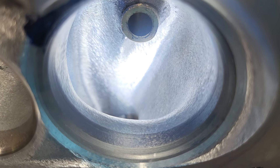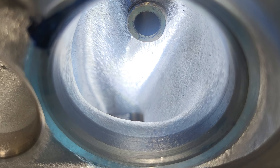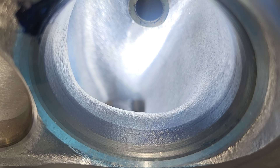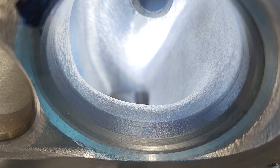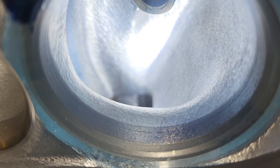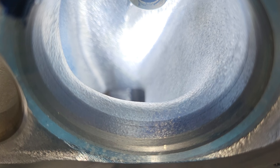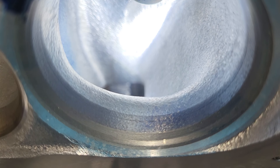The short side radius did get some work. If you remember, on the first cut we had a huge amount of noise coming off that short side, so I looked at my air speeds and modified accordingly. Did we get huge gains? Just by a quick look I would say no, but we did get some gains. You'll notice it still has a burr texture on that short side — that's probably not how these will go out. Usually I like a polished short side, but for development work this is what I use.